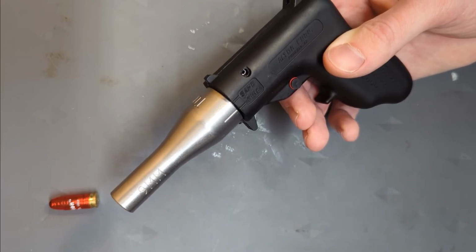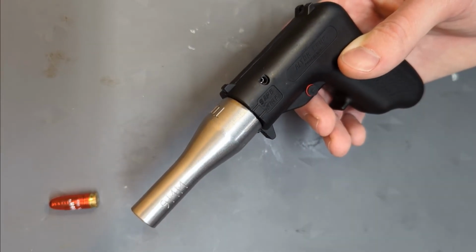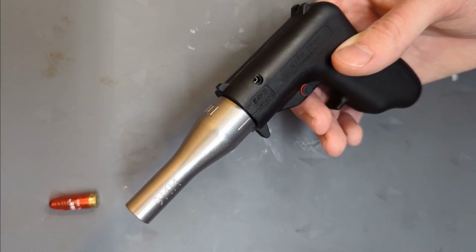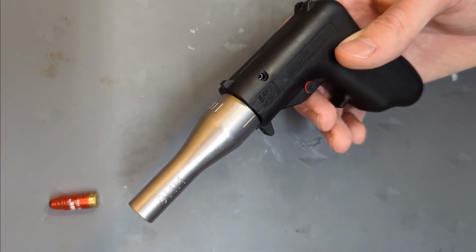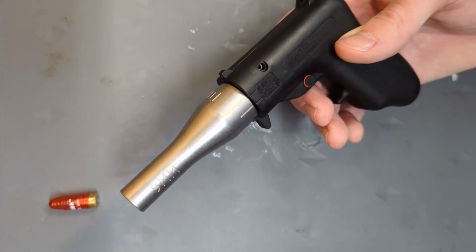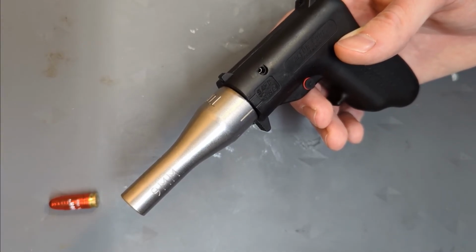The final thing to be aware of when it comes to the safety of this firearm is its inaccuracy. When bullets don't go where you expect, that can present safety concerns. Now, whenever you're out shooting, you should have lots of room for error with a sizable backstop, but it's nevertheless something you want to know about this firearm, that bullets may not go quite where you expect. This barrel has the absolute minimum amount of rifling necessary for the ATF to consider it not smoothbore. It's difficult to capture on camera, but trust me when I say, when you look down this barrel, you will find what look like four tiny scratches, rather than any kind of conventional rifling. As a result, bullets tend to tumble, and that does not amount to good accuracy.